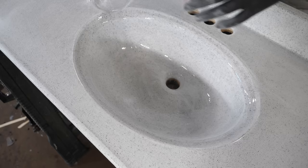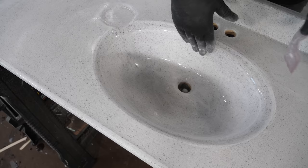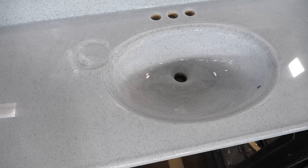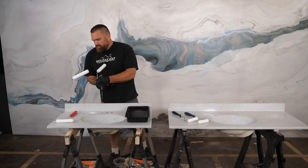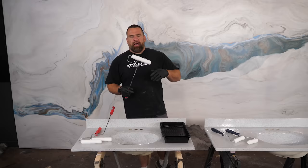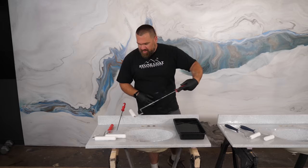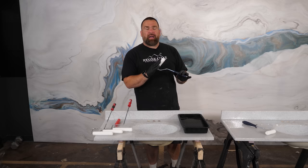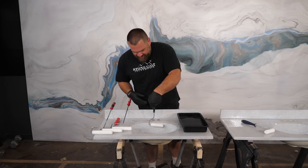Step one when applying the Ultimate Top Coat: lightly sand the epoxy with 220 grit sandpaper. Clean the dust with 91% isopropyl alcohol. A real light scuff is all that is needed — hit your edges too. Two coats of clear epoxy was the right call for these verticals and the backsplash, just because we added texture with the stone spray. It's real minimal texture, but it's texture nonetheless, so you need to overcome that and cover it.